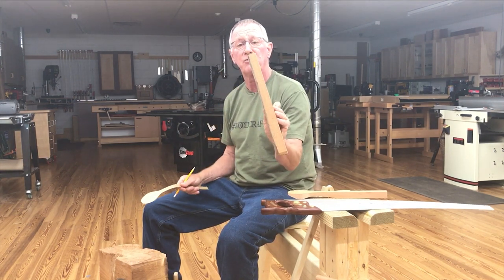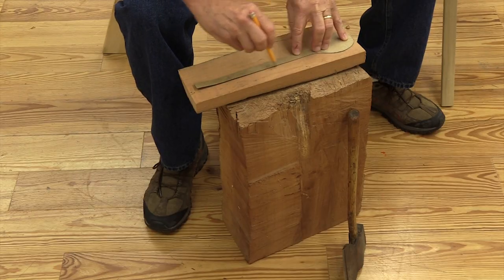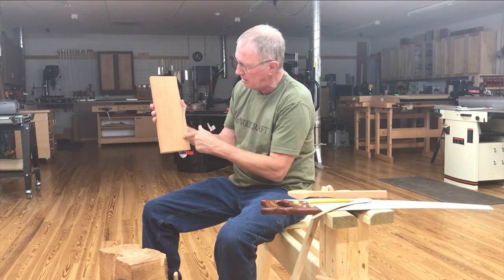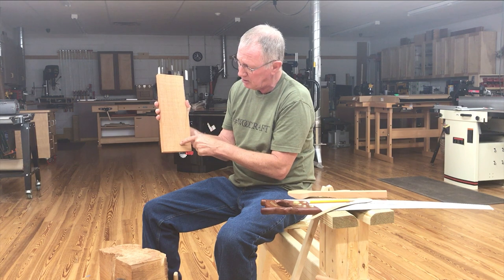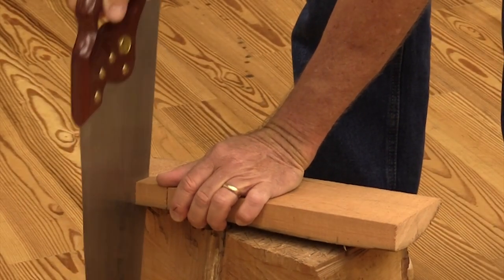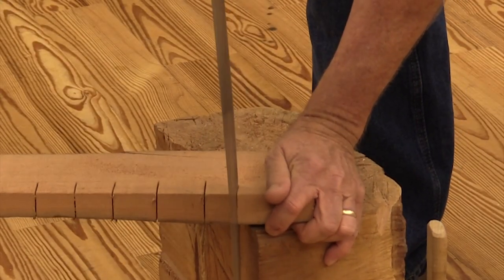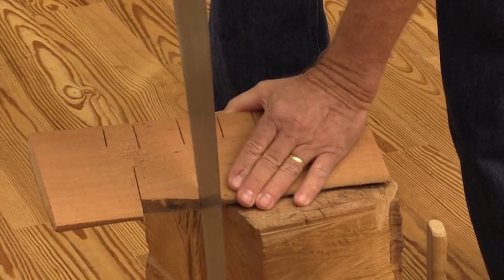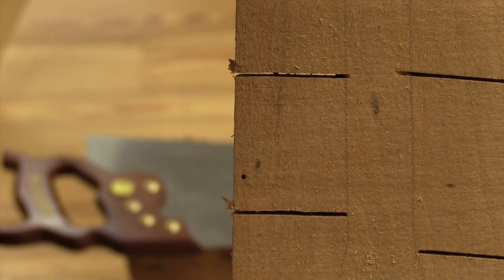This is actually just slab wood that came from an old cherry tree. I'm going to look for the thickest edge here — that's going to be the spoon part. So I'll trace my pattern. The grain on this wood is fairly straight and there's a good chance you'd be able to split some of the big chunks off without problems. However, there is a chance you're going to split part of the spoon off. The way to avoid that is to cross cut the piece along the handle, then use your axe to split it off so you can control where the wood splits. The saw cuts come right down to the line, so when I split this with an axe the wood will chip off at that point and not come into the handle.